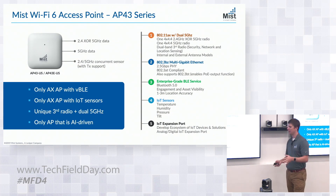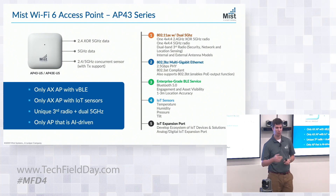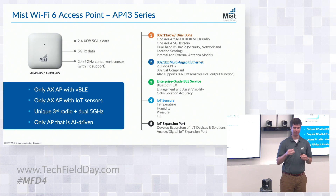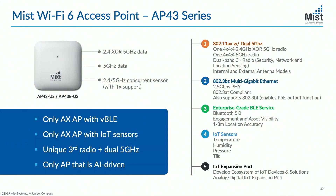What I'm most excited about — the second most exciting thing on the AP for me besides dual 5 — is all the sensors. We have a temperature sensor on the AP, a humidity sensor, and a pressure sensor. A couple of interesting use cases around location: being able to tell whether one AP is on a different floor than another AP, for floor location — placing the client on the correct floor.